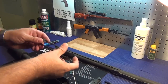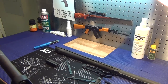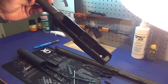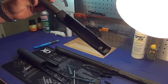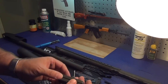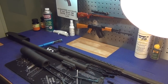The lever bolt comes out the front, and then off comes the slide or the pump. Again, there's a lot of stuff down in here — it's kind of a mess. The bolt is gummed up pretty good, a little bit of rust here — not bad — but it's a mess. We're going to refurbish this thing to make it work and run again.